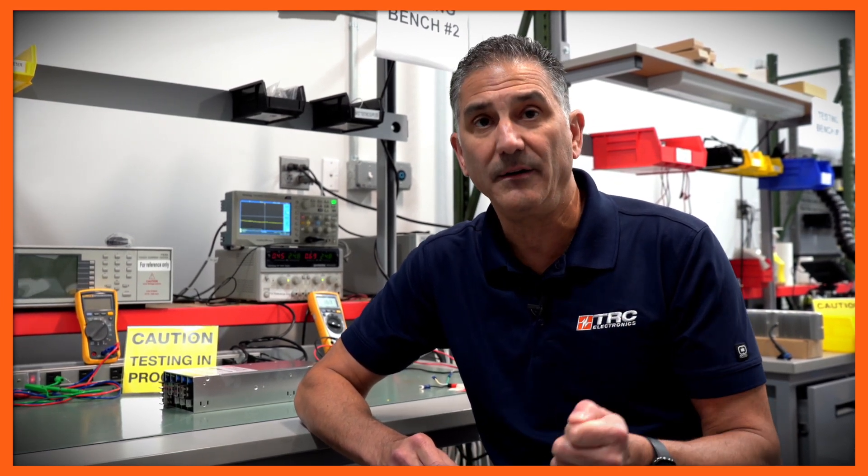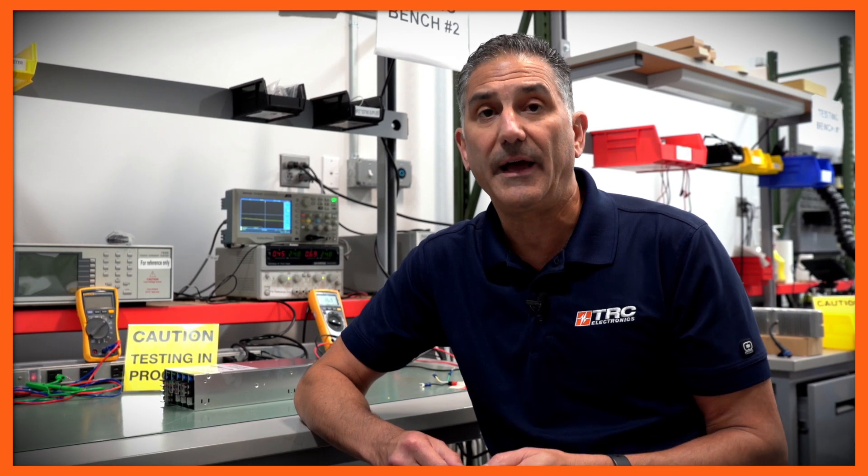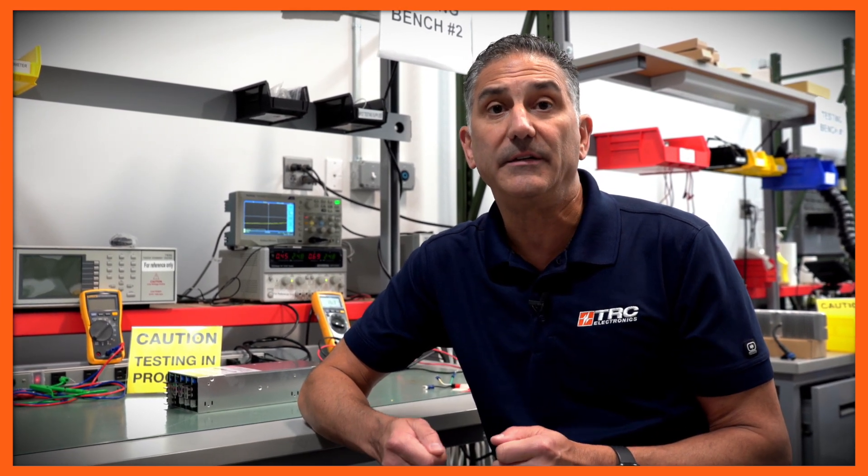The neutral is a return wire that eventually gets terminated at the electrical panel. So we're going to check today to identify which is the hot line and which is neutral, and make sure the ground connection is physically connected to ground. I've taped the wiring down so that none of the terminals will touch each other, spread them apart, and I'm going to energize the wires into a 120-volt connection.